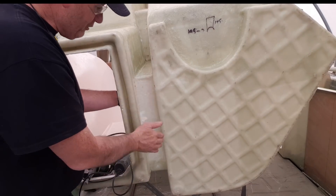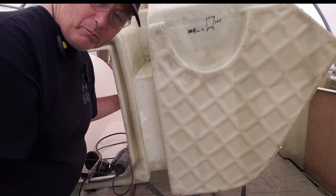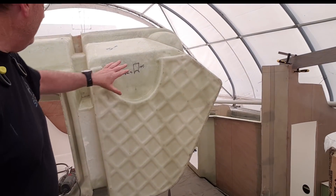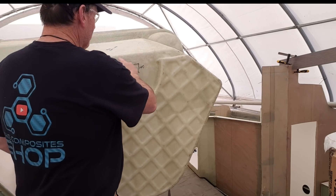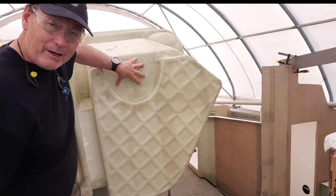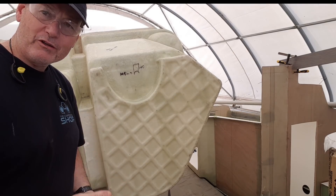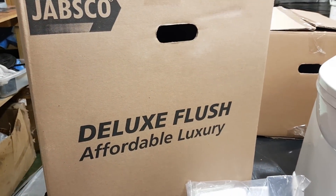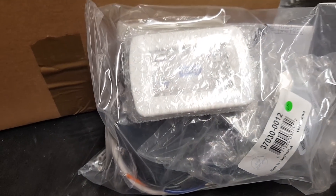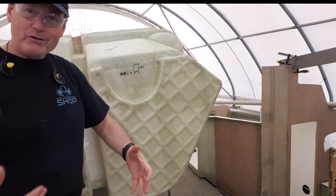Once all this is complete, I need to put some sort of a PVC conduit pipe through here to carry electrics through to the port side outside hull. Then I'll move on to the actual head section where the toilet sits. That needs to have a marine ply base — probably 12 or 25 millimetre marine ply — laminated and epoxied in there so I can screw the toilet down and be able to move it in and out as needed. The type of toilet I've bought is a Jabsco Silent Flush house size — a proper toilet — with a slanted back that conforms to the actual head.